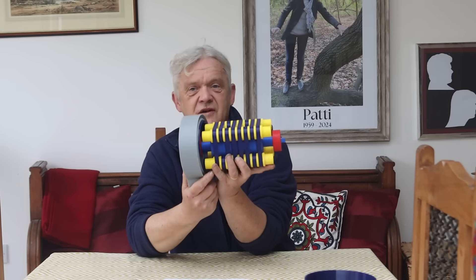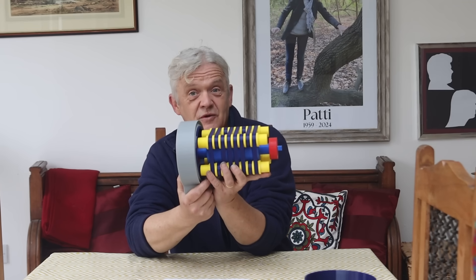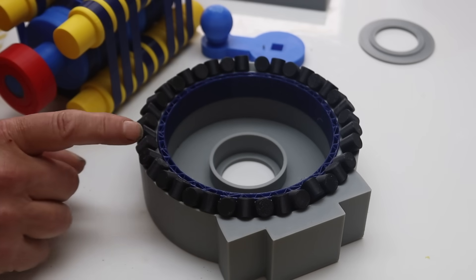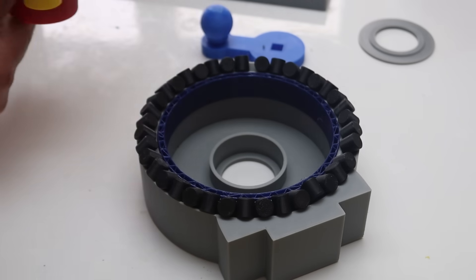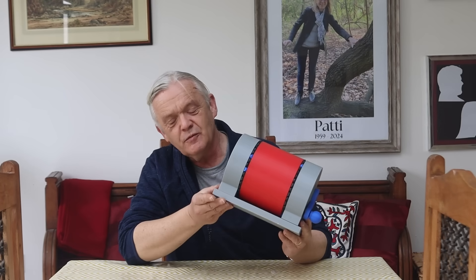We fit that and squeeze it into the ground section — we need two of them. Before we put the other ones in, we also need the output ring. There's our ground ring glued in place with cross rollers in that groove, which then slots in there. The output ring — this big red ring — slots on top and has an angular groove that takes the other side of the cross rollers. Inside, it needs its own TPU sleeve so it can grip. The TPU sleeve inserts into that ring and fits closely over the rollers. Putting all those bits together, we place it in the base. Finished — put the crank handle on, we're ready to go.